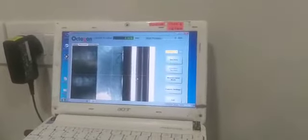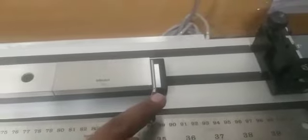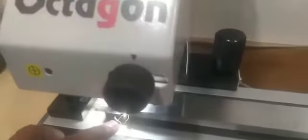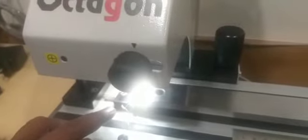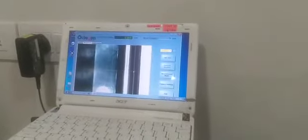We have a 500 mm slip gauge, a 400 mm slip gauge, and a 90 mm slip gauge on both sides, plus a 4 mm measuring pin on each side. The total measurement is 599.98 mm.